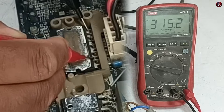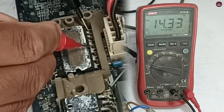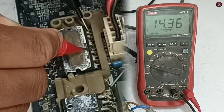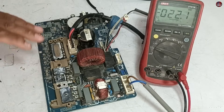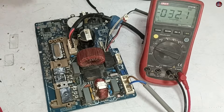The DC voltage on the positive pin reads 315 volts, which is fine. The U pin has 14.41 volts — fine. The V pin reads 14.55 volts, and the W pin voltages are also fine. This means the high side of this circuit board is good and there is no problem with it.